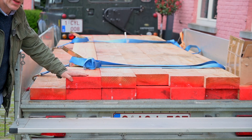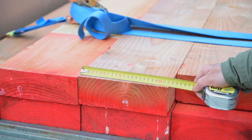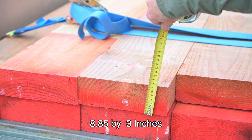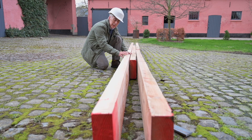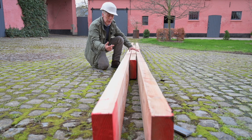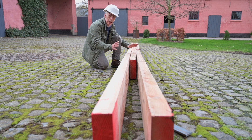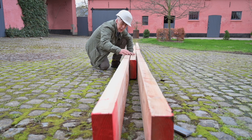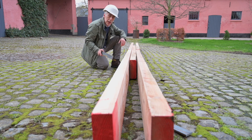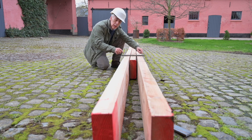And voila! This is the wood we're going to use — Douglas pine. Ideal for construction work. The width is 225 millimeters, the widest you can get. The thickness is around 75 millimeters. We're going to build it with two beams for one span, two on the other side, and one middle beam. We'll place bolts straight through the wood right in the middle at regular distances so it's held together very well. We'll also fill the gaps with leftover beam material, and then the brackets will come over with two rods going down to hold the old beam.